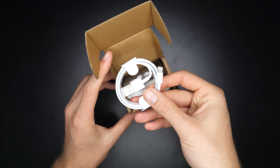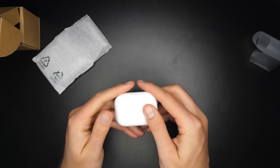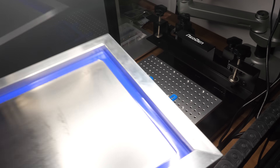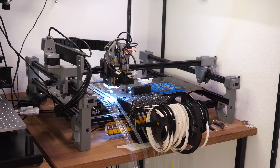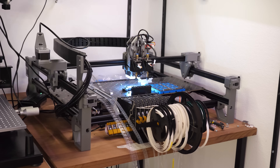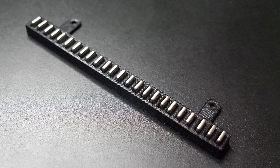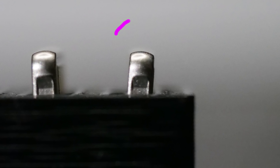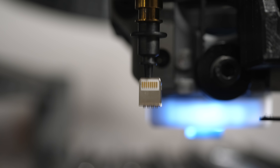Very soon I'm not gonna need that anymore. The cases are ready and I've received my PCBs. Now we add some paste, place it on a pick-and-place machine and let it do its job. But how do I get those connectors in place? Well, I made this cool little tray to pick them up one by one — not so much. Looks like it's got this curved shape and I can't find any nozzle that works well with it. Guess I will just place them by hand.